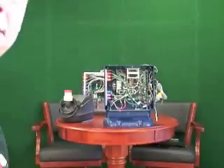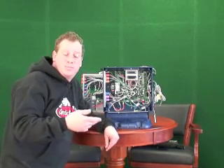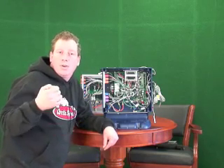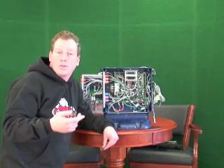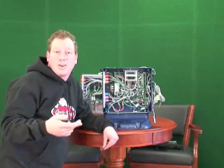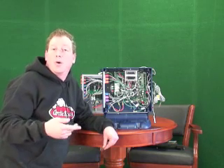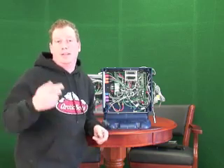The reason we need to know this is: if you're originally running a 110-volt blower and you come out and swap in a 230-volt blower, it's only going to get half as much power and won't perform — and you don't want to be going back multiple times trying to diagnose why it isn't working. Conversely, if you have 230 volts going and you plug in a 110-volt blower, you'll most likely cause severe damage to the electrical components inside the blower. That's a wrap — on to the next segment.